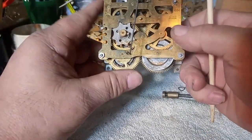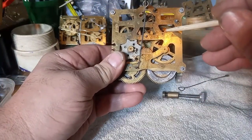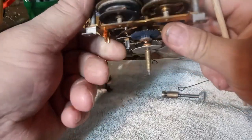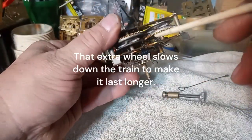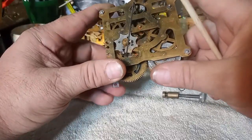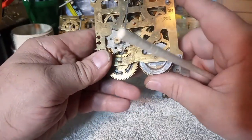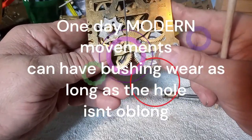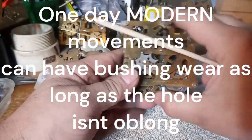This is a Regula eight-day movement. It has a great wheel, a second wheel, a third wheel, and then the escapement wheel — it has an extra wheel in it. There's actually one extra piece in an eight-day movement that you should be able to see. What I will say about an eight-day movement is: if there's any bushing wear whatsoever, you might as well go ahead and put bushings in, because your clock probably will not run.